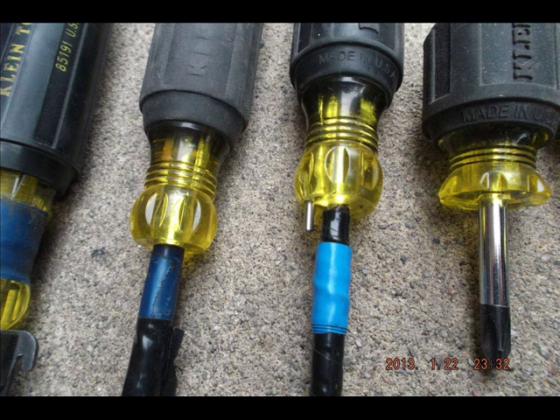Take a close look at the common screwdriver. There's a metal post that if you put a solid wire in there — number 12 or 14 — you can just twist the handle of the driver, and it puts a nice loop in the end of the wire that you can use to put around a screw. I recommend getting a driver that has that metal post.